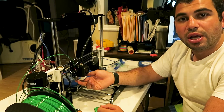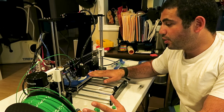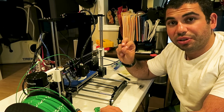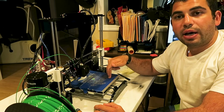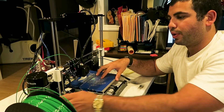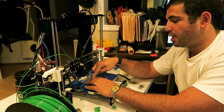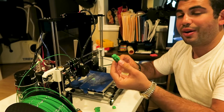Make sure you clean off that nozzle before starting. Another big issue: even with a heated bed at 70 degrees Celsius, the print still had trouble sticking to the bed. If the filament grabs it even slightly, it moves the print off center. To fix this, I put painters tape down — replacing it each time since it gets ruined, which is normal — and then sprayed 3M high-strength 90 contact adhesive spray on top. That makes it stick very well and ensures a nice print at the end.